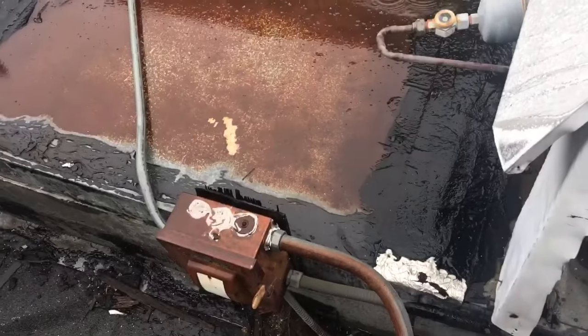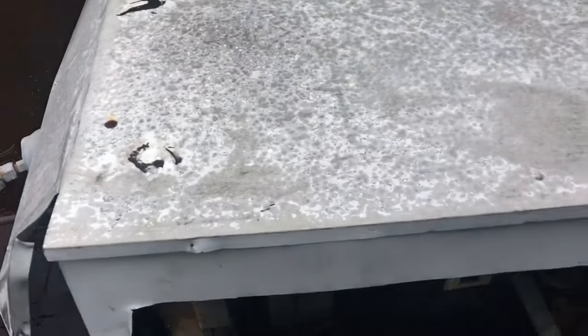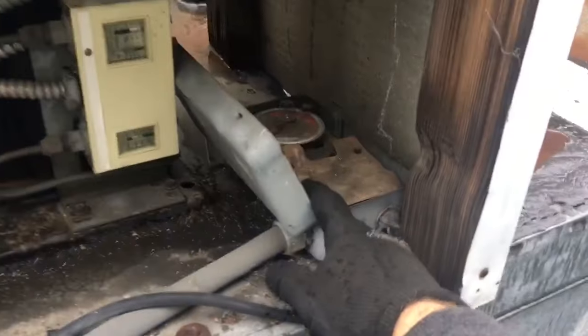All right, so I just got out here, and this one's classic. Like what I'm standing in, that's like the edge, and look at the roof here. I'm noticing this thing's flooding back, so the coil's probably iced up. We've got to go take a look at that. I turned it off by the defrost timer here. Look at this thing.